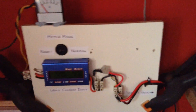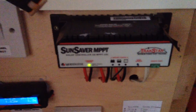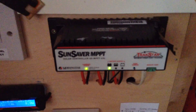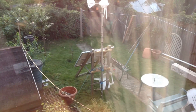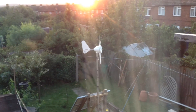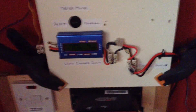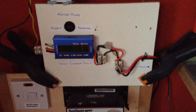I charge my battery bank with wind but most of my charging comes from solar. I have a SunSaver MPPT charge controller — it's a 15-amp controller made by Morningstar — and outside it is hooked up to 200 watts of monocrystalline solar panels, two 12-volt panels wired in series. That is my Rutland 913 wind generator. These two charging methods operate in parallel; both charging sources charge the same battery bank.